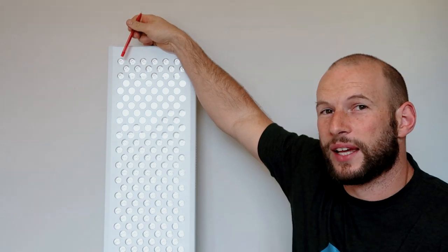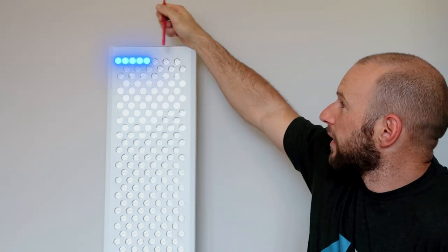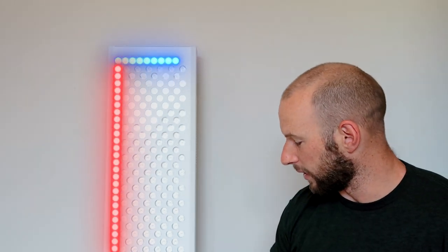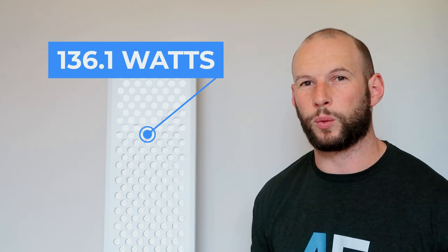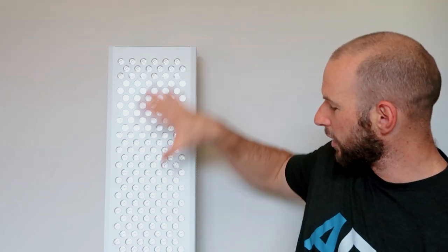That's how I test average combined power over nine points, also at six inches, for both red and near infrared combined. The reason I take this average is so I can calculate the total output power from a panel. I measure the surface area of the LED array — from the edge of the LEDs on one side to the other — getting the width and the height. I multiply those together to get a figure in centimeters squared, then multiply that by the average power output to get a total figure in milliwatts, which I convert to watts.